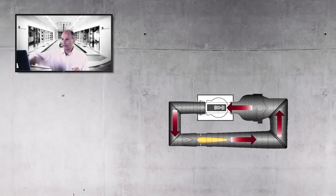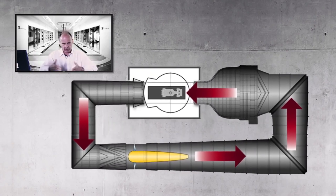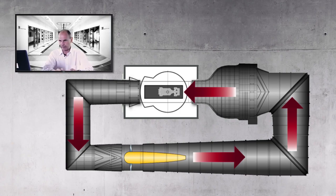And then there are other ways that wind tunnels have changed to suit motorsport more than the aerospace industry. When air passes over any surface, you get a boundary layer growth. So if you blow over a table, then the peak of airspeed is not going to be in contact with the table. It'll be a little distance above, because there's a certain amount of friction between the air and any stationary surface. And all the way around your airline of a wind tunnel, that boundary layer is growing. And one of the things that the contraction does is it also shrinks that boundary layer a little bit.